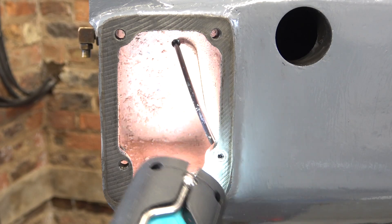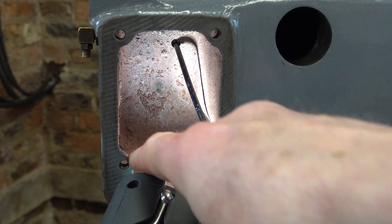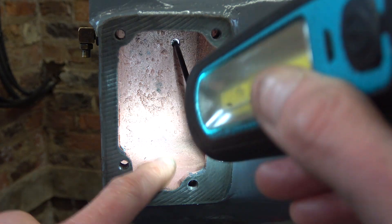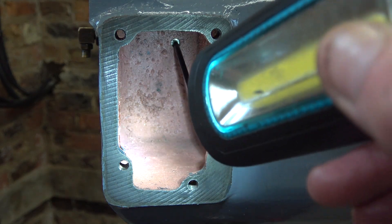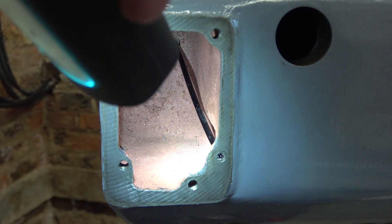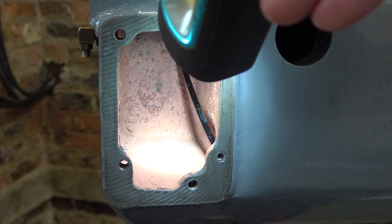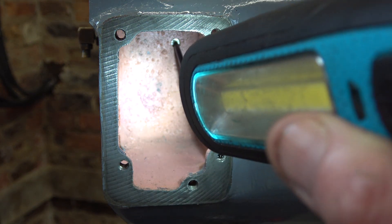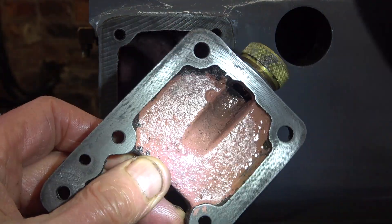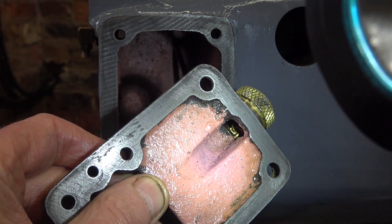I just took the front off so we can see what we're doing. You can see where the pipe starts and runs up to the back, so the oil we had in here was not going to run up that pipe — if there's oil leaking from in here it's got to be from lower down. You can see it's painted pink — I thought maybe the pink painting was a coating to stop leaks if there were pinholes. But if I show you other pieces, they haven't painted behind this corner or across here — they've missed bits inside. They have painted the front piece but it's not fully painted, so I don't even understand why they painted it unless it was to block leaking pinholes.